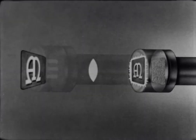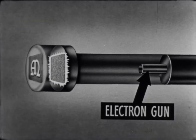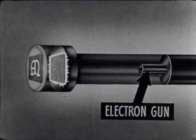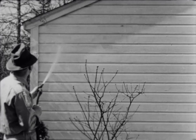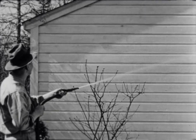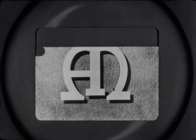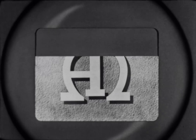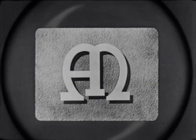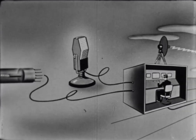In reality, this image would be inverted within the tube. At the other end of the tube is an electron gun that fires a fine stream of electrical energy across the target — much as you might turn the garden hose in your garage to clear away the winter smudge — from left to right and from top to bottom. If you could slow down the operation of the tube, the target might look like this, as the electron beam clears the picture point by point, line for line. But actually, the beam moves at the unbelievable speed of more than 500 lines, 30 times every second.